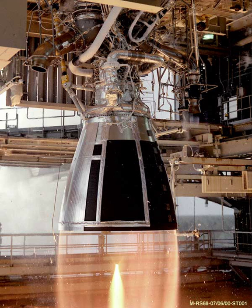As its predecessor the YF-75, it can adjust its mixture ratio to optimize propellant consumption. But as an additional improvement, it can do multiple restarts, against the single one of its predecessor. The combustion chamber required a redesign to keep the power balance.